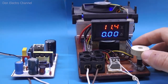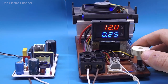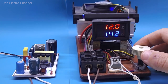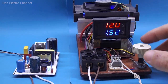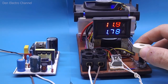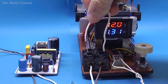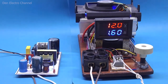To check the power supply at maximum power, I connected an electronic load and slowly increased it. The first line of the display shows voltage and the second shows current. At 12 volts and 1.5 amperes it is stable — that is 18 watts, everything as required. After the load exceeds 1.7 amperes, the voltage begins to sag. Also, if a short circuit occurs at the output, nothing bad will happen — the voltage drops to zero, and when the fault is eliminated the power supply recovers.